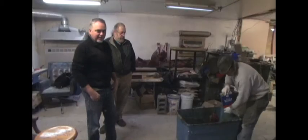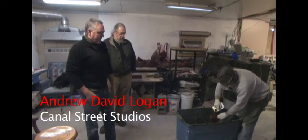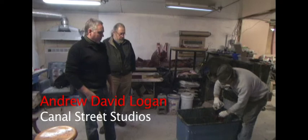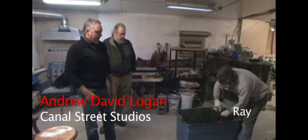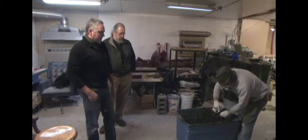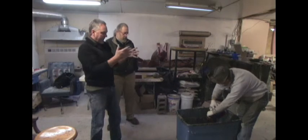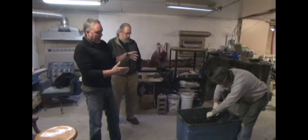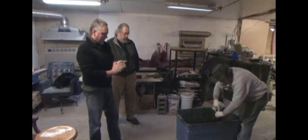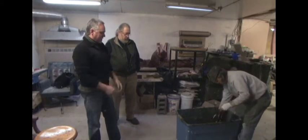What's happening here is we have Ray Fauntz, who's the head of the foundry, cleaning a couple of the elements that Yuri has designed for the Isaac Witkin portrait. These elements are the brown wax, which we'll show you in a second when we pull it out of this pot — that will be part of the casting — and the red wax is part of the plumbing that we create to distribute the bronze throughout the casting.